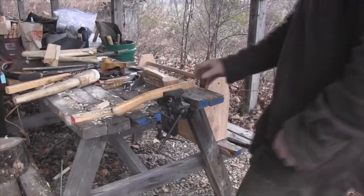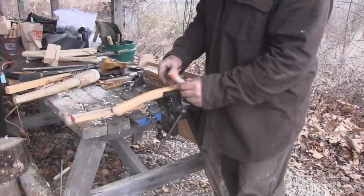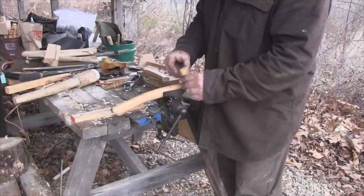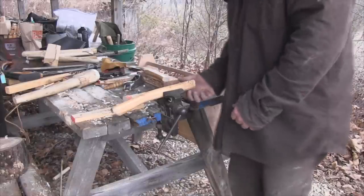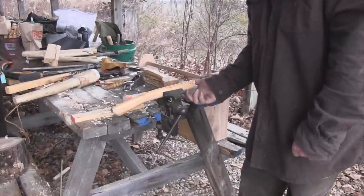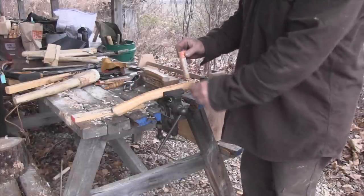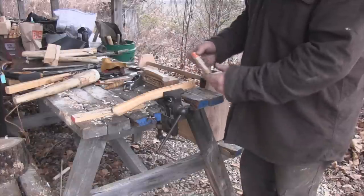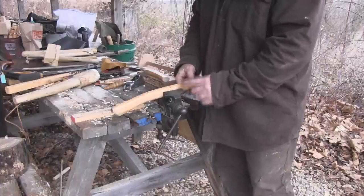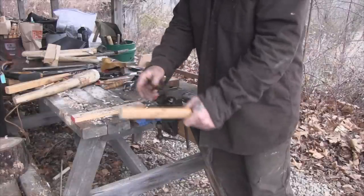Now I'm taking an old axe handle, cut it off, and cut another piece from it — this is just an old hardware store handle. This extra piece is going to be my wedge. My game plan is to bring the tang up through the hole in the tool and drive this wedge down in front of it to hold it in. It's going to give me a little bit of a curve there.